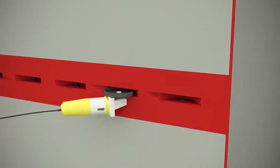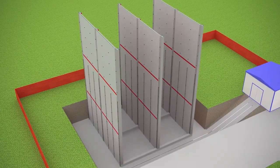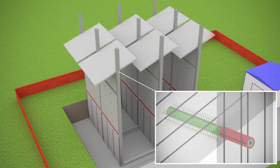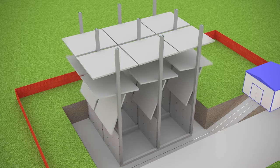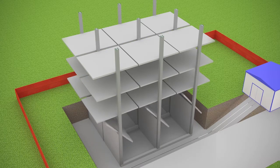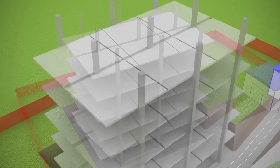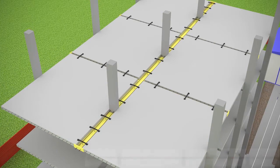Before rotating the floor plates from vertical to horizontal, the tensioning cables are cut at the horizontal divider between 2 plates. After this step, the jack supports are removed using winches and the plates are rotated. Once the floor plates are rotated into place, the gaps between the plates need to be filled with concrete. Formwork is installed to support this step.